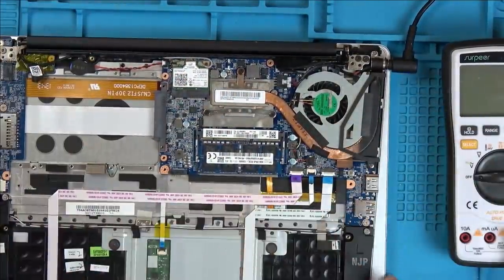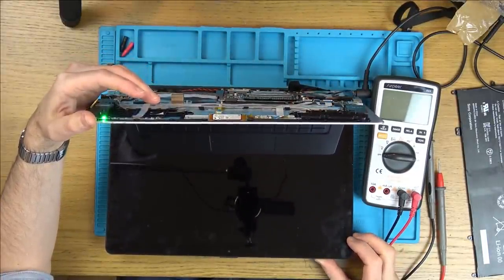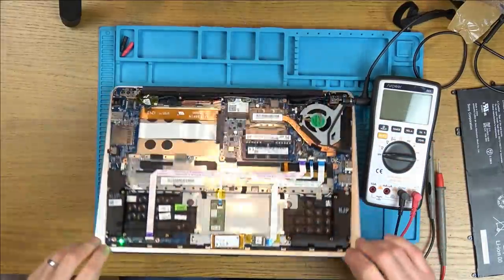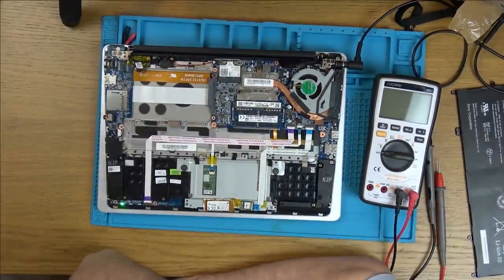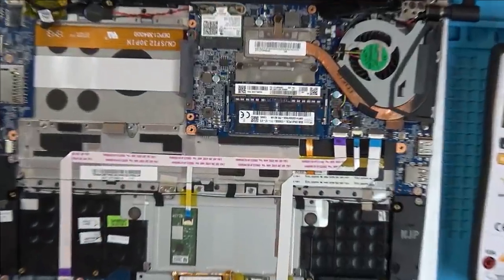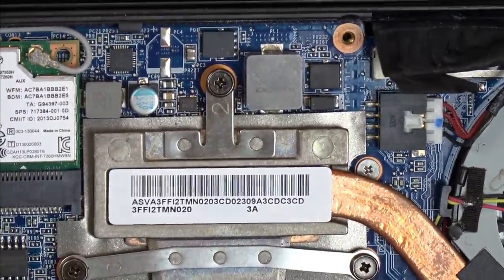Let's turn it on - we've done the BIOS battery. Green light, but then it goes out. So it's like it's power cycling, coming on and off - it's trying. So where would these two MOSFETs be? Normally when you have the input, you have two MOSFETs. Would it be these two here? Let's zoom right in on this section. It's one of those boards where it's a bit awkward to see where the traces go.